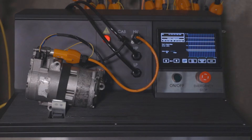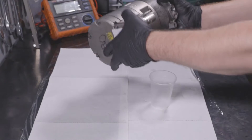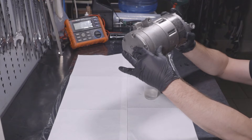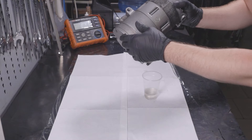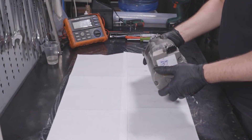To determine the remaining service life of the compressor, we perform an internal inspection of the scroll rotor parts and check the spiral rotor for wear and tear. For testing on the bench, it is sometimes necessary to use special oil in an amount of more than 30 grams. After the test, we drain the working oil and fill in the native oil.